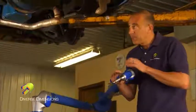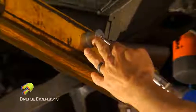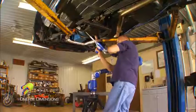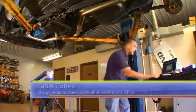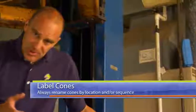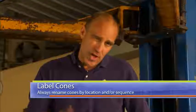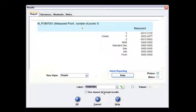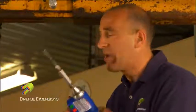The software is ready for me. I'm going to go up to the front side here on the hoist for my first comp off point. I'll lightly put the probe inside of that cone — one click and compensate. I'll lay the arm down, because usually what I do 100% is I like to change the name on these cones and give them a name that makes sense. Sometimes I'll put some masking tape or a paint pen if I'm on a tool. In this situation, I can pretty much name the cones where they're located on the underbody. So I'll say this would be the driver's side front cone. Now it's assuming I'm going to keep measuring cones, so I'll measure the next three cones and then go back into review features and rename them to make this a little bit quicker.